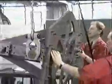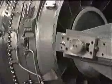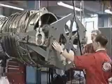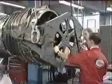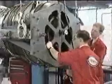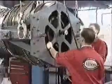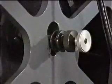The handling fixture can now be fitted. Lift the fixture with the 2 cable sling attached to the 2 rear trunnions and align with the rear of the LP turbine. Carefully push the handling fixture over the expanding retainer until it contacts the turbine exhaust case rear flange. Then lift into the correct position.